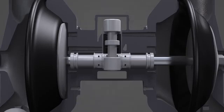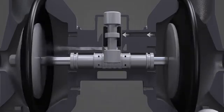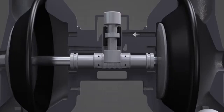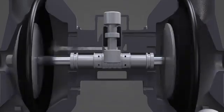rear of the pump. When the main air valve is in the up position, air pressure is diverted to the left diaphragm, while the right diaphragm is exhausted. This process constantly alternates between the up and down position to create a continuous cycle.